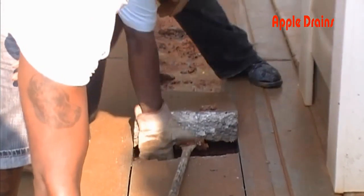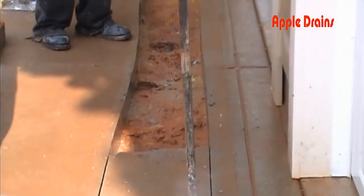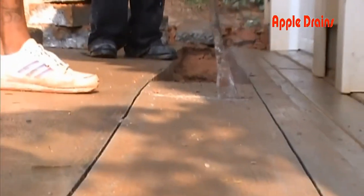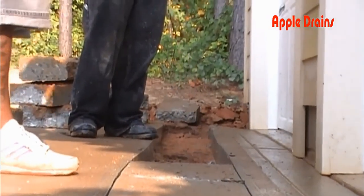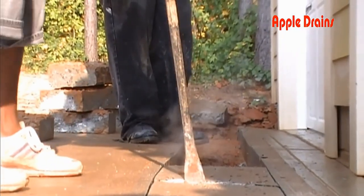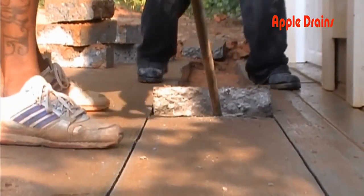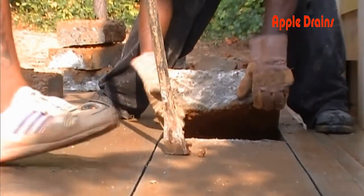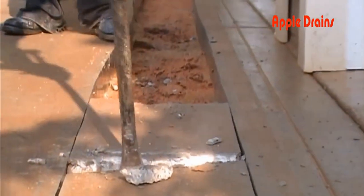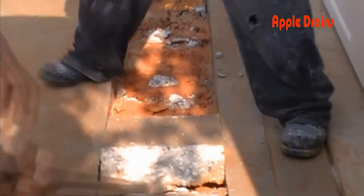Here I've got two guys — one's cracking the concrete and the other's lifting it out, and this is probably the easiest part of the job. We do have a jackhammer standing by, but this concrete pour was 4 inches, which is about normal. However, in driveways they can be 6 or 8 inches, and the partner saw only cuts 4 inches — in that case you'll have to use a jackhammer or get a bigger saw. But this works really good on this installation. You can see each time Kamari breaks up the concrete with just a few hits and Eddie can lift it right up out of there.